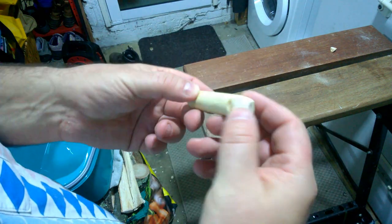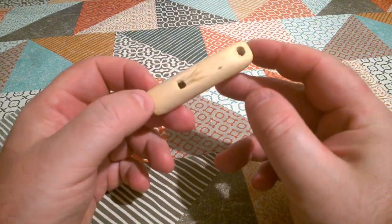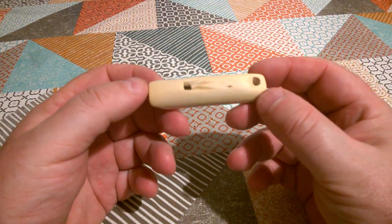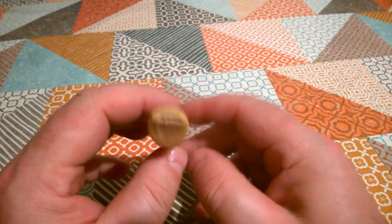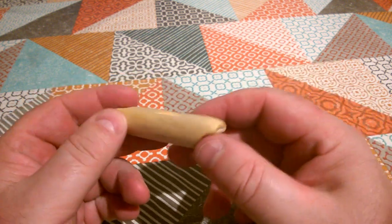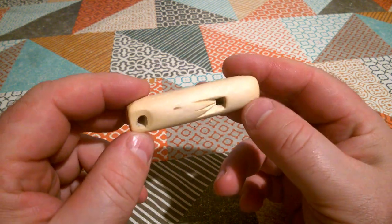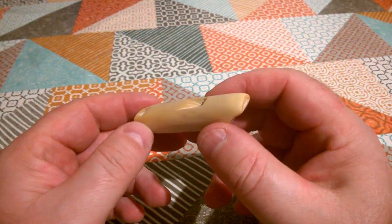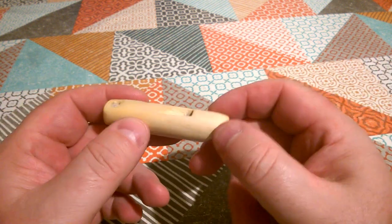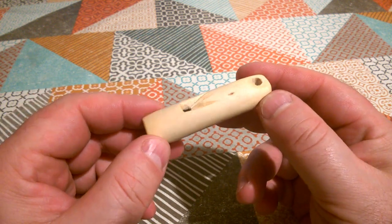The rest of it's just going to be sanding, smoothing off odd corners, and then finishing with a bit of oil. So that's the finished whistle with a coat of oil on it. I made this with just a drill, a few hand tools, and some sandpaper — just to demonstrate that you don't need a drill powered lathe or a wood turning lathe to make a whistle like this. I used a stick of elder which was easy to drill out because of the central column of pith in the branches, but you could use any kind of scrap hardwood really. So I hope that's been interesting — thanks for watching and I hope to see you again soon.